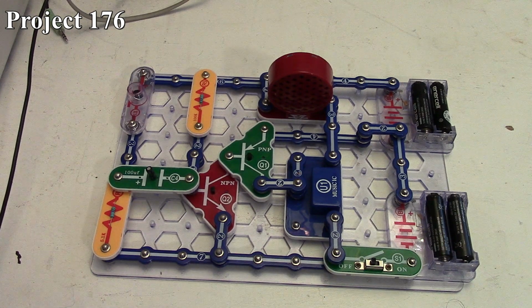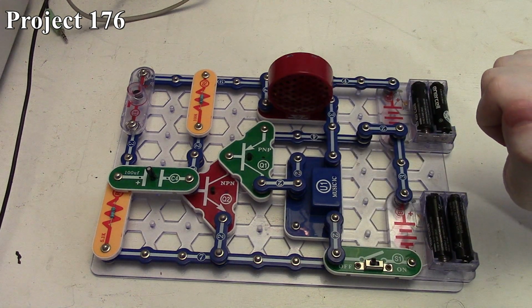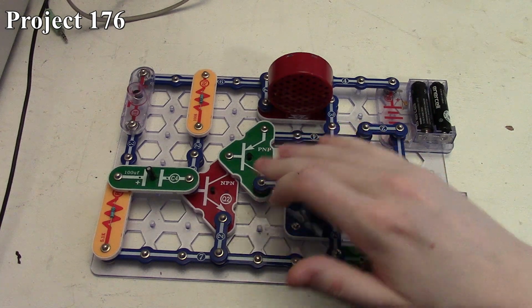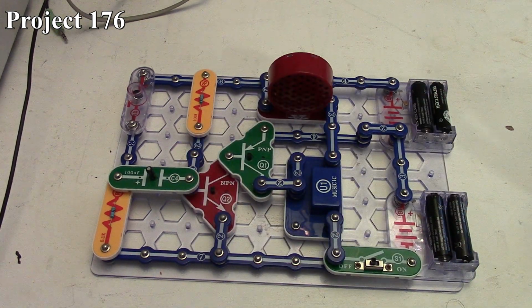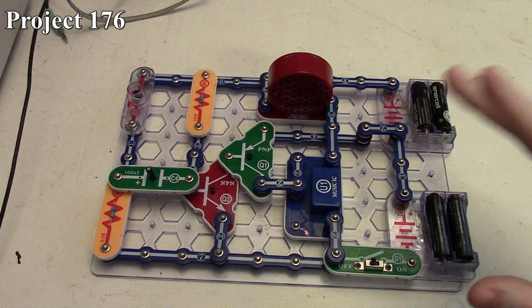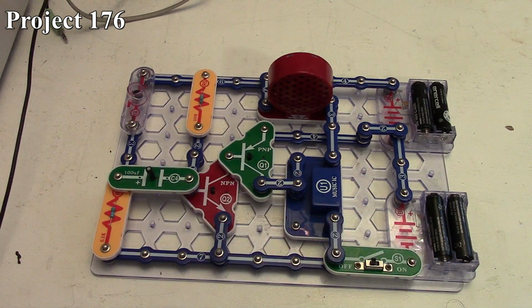And the way this circuit is going to work is when we power it on, the music IC will produce an audio sound through our speaker, and it's going to be turned on by our two transistors here, our PNP and NPN. And our resistor here is going to constantly feed the NPN's gate so that the circuit stays on. Now, what we do with blowing it off is we're turning the circuit off momentarily, and we're doing that using our microphone and capacitor and resistor over here.